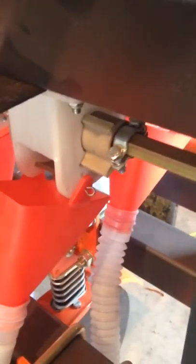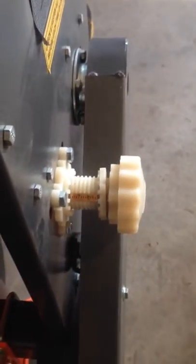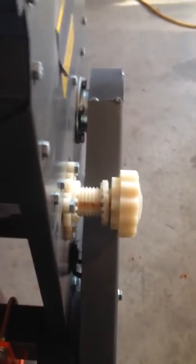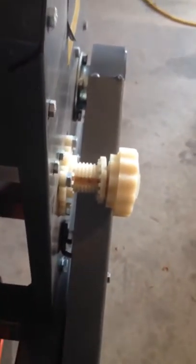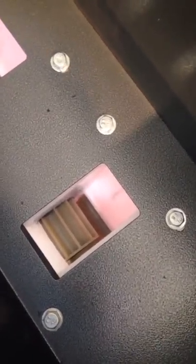The problem is that they tell you it's all calibrated for seed rates based on this little number gauge here, which is wrong because the shaft isn't quite set in there right for those numbers. So it's going to be a relative thing. This feels like some kind of nylon or HDPE — I'll probably have to put some silicone grease on this to keep it from seizing up, because it feels like it wants to stick.